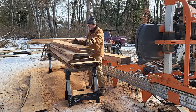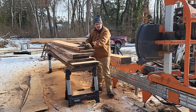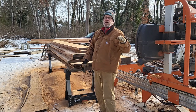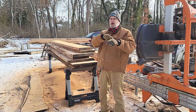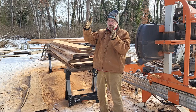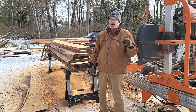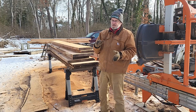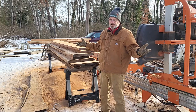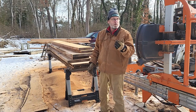Take off this end 3 feet. And actually that end 3 feet, the reason I'm cutting 11.2s: the trailer has 2 angles on it. It goes up like this and then angles a little bit, and that's a little 2-foot section of boards going across, and then it goes into the flat. The 8'3"s go sideways, and I had already figured if I just cut everything at 11.2, that gives me an offcut on the end to use in that little 2-foot section going the other way.